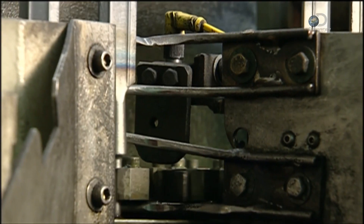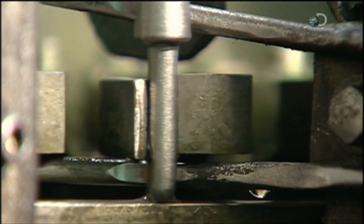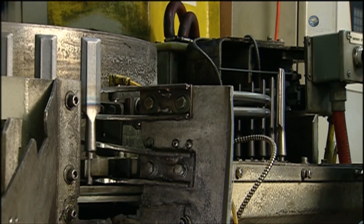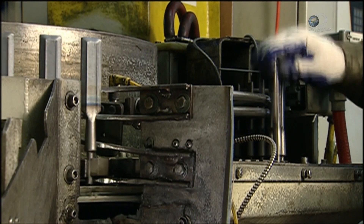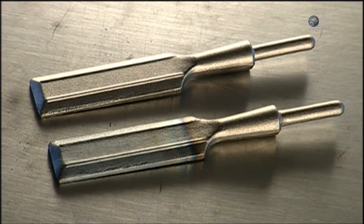The next coil heats them to about 370 degrees Celsius. This step is called tempering. It relieves the stresses that the quenching phase created inside the metal. Spring-loaded clamps now release the chisels from the machine, and they drop into a container to cool overnight.